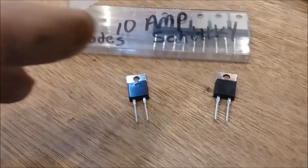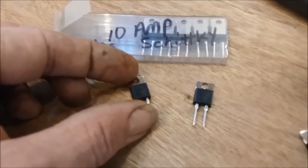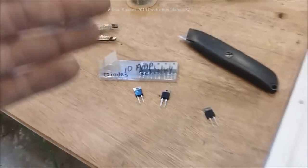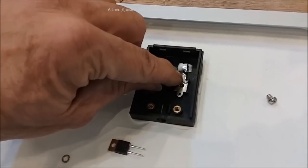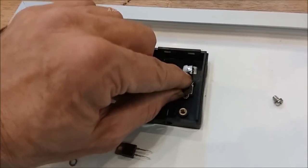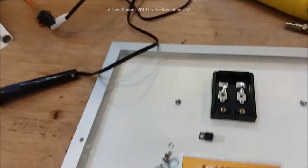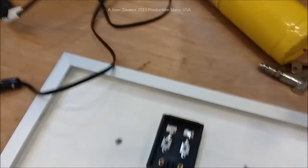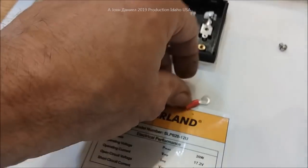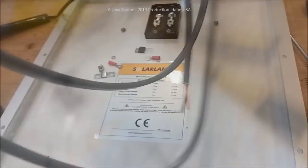There is lettering on one side of the diode — it's staggered to one side, which gives you an idea that is the incoming side. I went ahead and severed the bus tape on the positive side — you can see the plus marking — and I checked it with my meter to confirm it's a functioning panel. I'm using standard 16 to 18-gauge outdoor-rated wire for this.